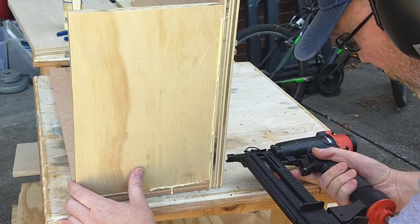Watch to the end so you can see where I goofed up. Back to the build. My preferred method of box building is brad nails and wood glue. The nails hold the pieces together long enough for the glue to cure. The glue holds the box together and seals the edges. I like this method because brad nails are cheap — this is the Budget Bass Box, and cheap is what we're looking for.